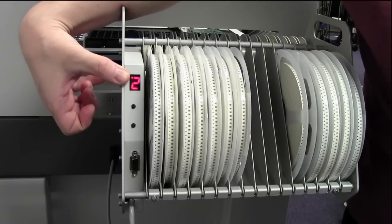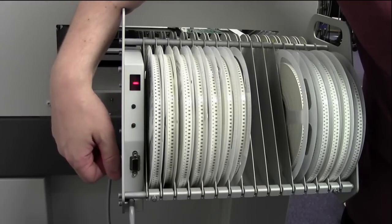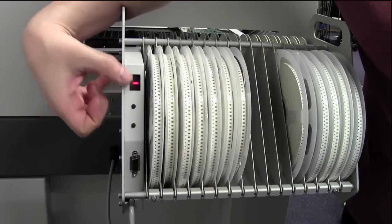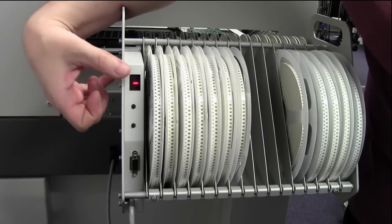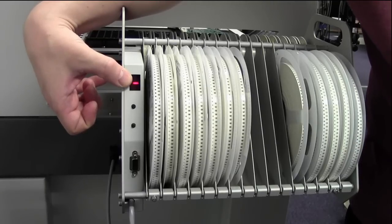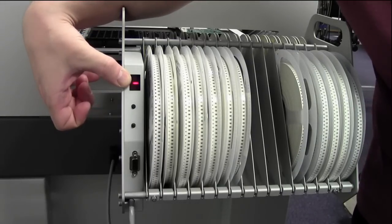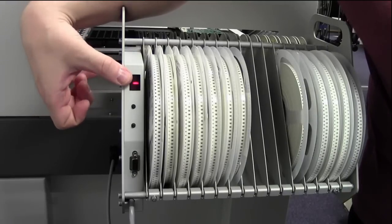After doing that, you press your bottom button, and it displays bars now on the display, and the bar sets your feed rate. So it depends on where the bar is positioned, or you've got double bars and so on. You can set the feed rate. The feed rates are, I think, in 4mm, 8mm, 12mm, and so on, up to I think about 20 or 24mm. That's all coded in using the bars.